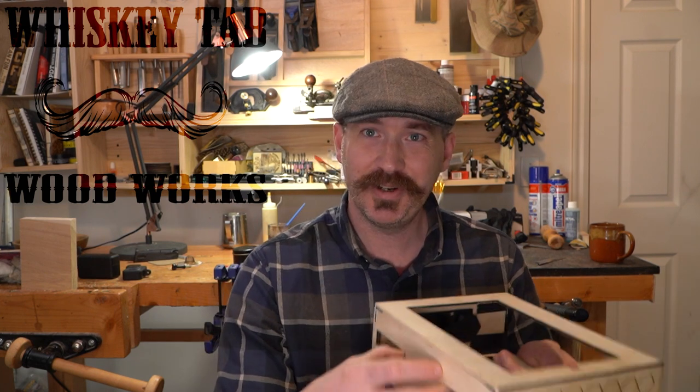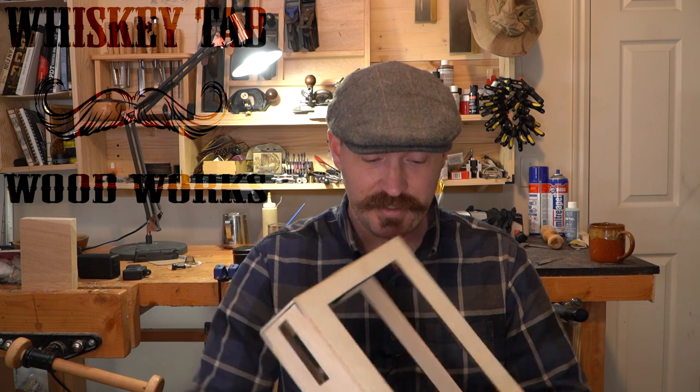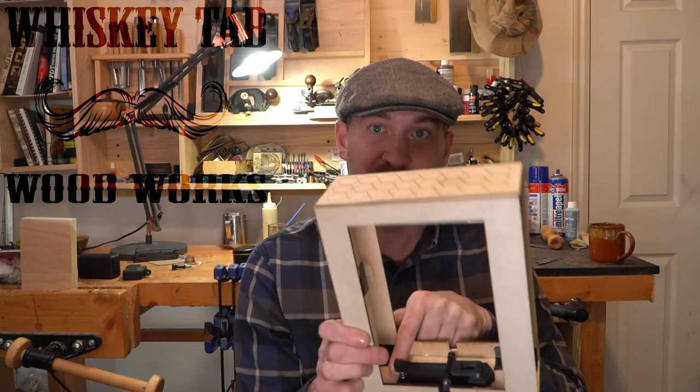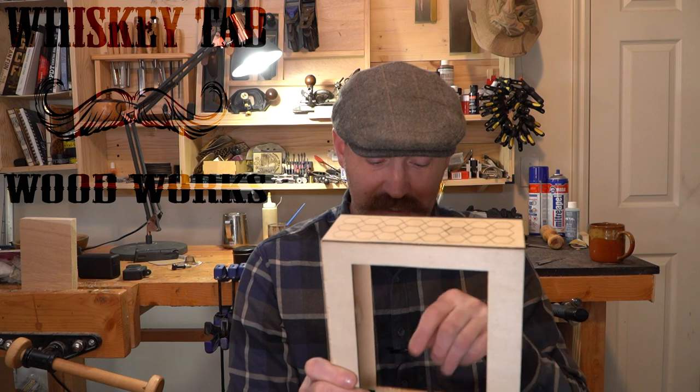But the goal is once those are all lined up, the back panel on the box, instead of going side to side, I'm going to make it so it comes out. And when you pull it out, that will remove a block that will be behind both these sides, preventing you from being able to push it down. So as you pull it back, it'll move that block out of the way. And then you can depress the button and slide the box open.